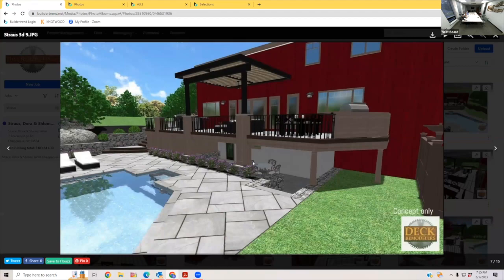And these drain. It has an internal gutter around the inside of the frame, so when the louvers are closed and it's raining, they're pitched just slightly so that the water runs to the internal gutter and then down. And then where does it go from there? Into a leader, and we'll tie into the existing drain because they have an underground drain system for the leader. Is that going to be on the house or on the post? No, it'll be on the house.